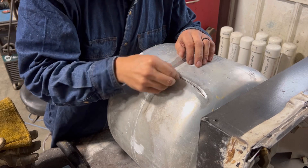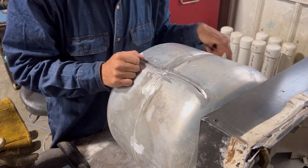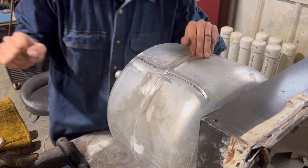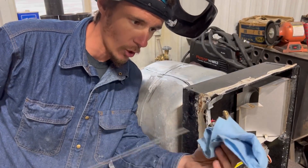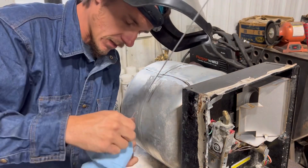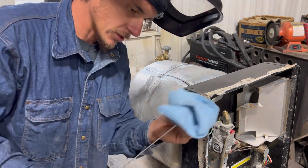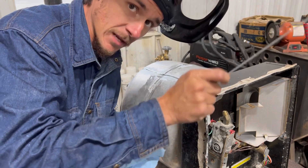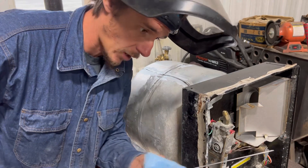I'm going to go ahead and weld this section up, and then finish this side out — maybe even tackle the whole long weld we've got going over here. But first I'm going to acetone this thing one more time. As any halfway decent aluminum guy knows, you should always acetone down your aluminum welding rod — it's going to up your chances of not having porosity and give you a better, cleaner weld. You can see all that contamination was on the outside of this rod and could have been in our weld puddle. So if you're welding aluminum, especially something that's going to be pressurized, clean everything.